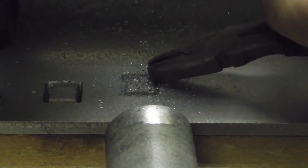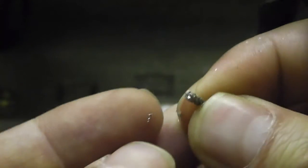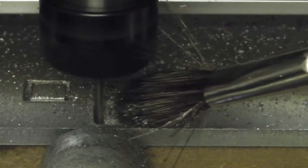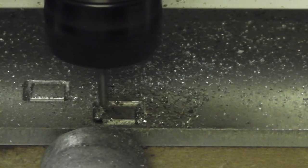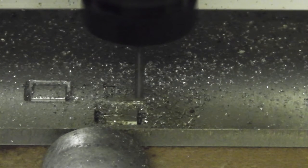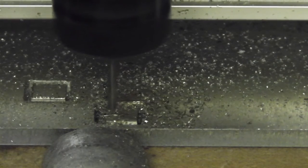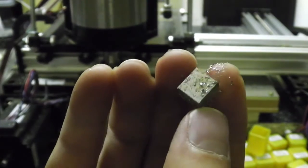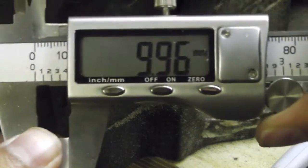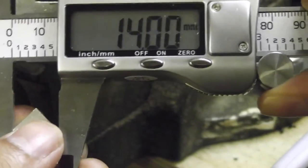At this point I could have tried tuning the machine to cut with that smaller bit in a slightly more efficient way, but I decided to change to a 3mm single flute bit. I exported the G-code from SketchUp again, setting the bit width to 3mm. I'm just brushing on some thickened WD-40 that had been lying around in the workshop for a while — this is obviously an unusual lubrication method, but this is strictly experimental at this stage. On this cut I made the tabs a little bit too thin so the piece had actually separated on its own, but it came out pretty well. I probably could tune the machine up to cut at a greater accuracy than this, but this is certainly sufficient for cutting plates to make another CNC machine.